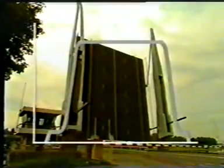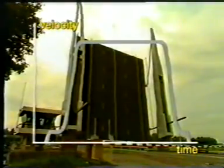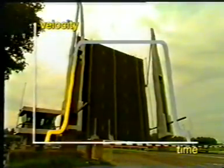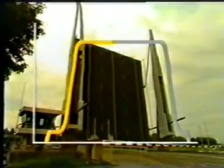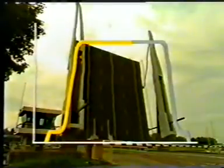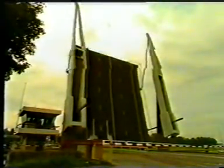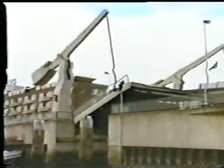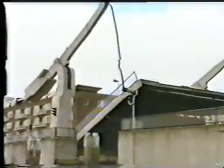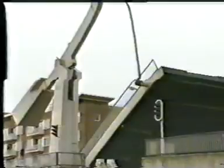By using a motor with electronic speed control, a prescribed velocity-time diagram can be followed exactly: brake loose, creep, accelerate, constant velocity. This type of bascule bridge can also be opened and closed hydraulically. The speed is controlled by a variable delivery pump or a flow control valve.